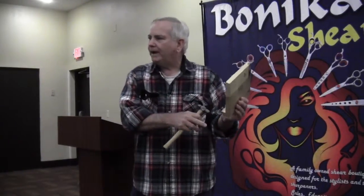I usually try to line up with the back rail, but depending on the blade, sometimes you want it more or less. But just by tapping it, I can get it back to where I want it. I used to use a screwdriver with a heavy handle, but a lot of times when you're crimping the socket to make it tight, tightening the spring up, you'll take some of the bend out of it. So it's hard to get that cutter all the way back. With the hammer, I was able to really hit it pretty hard and push it back.